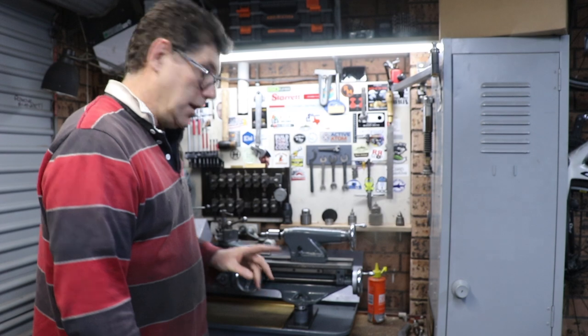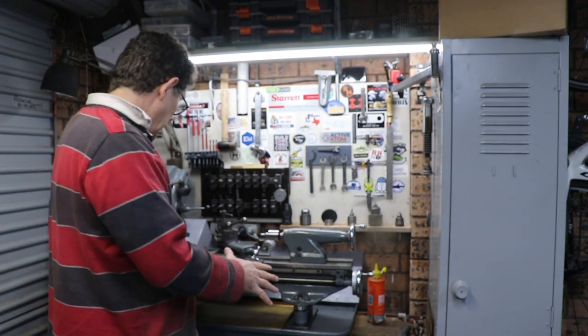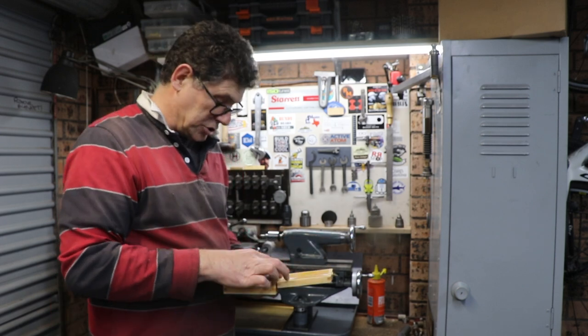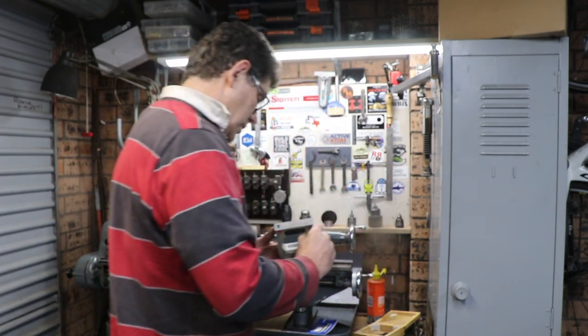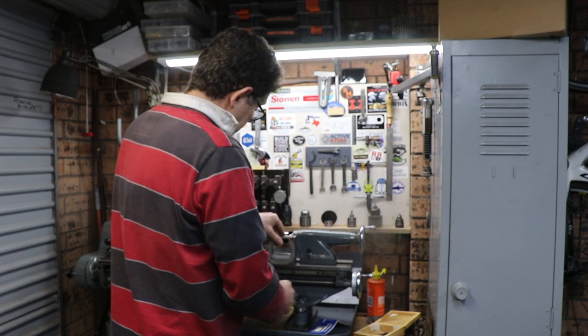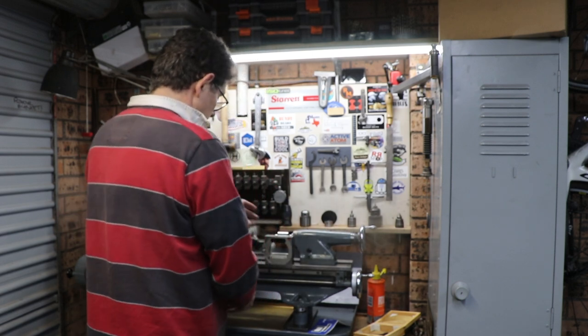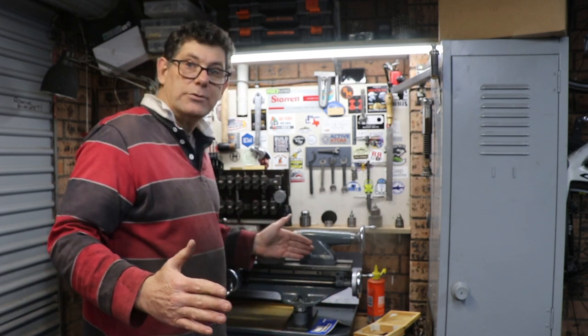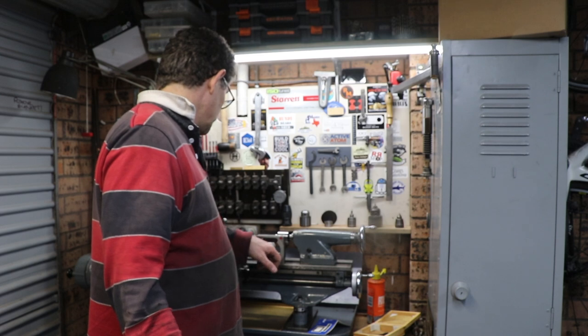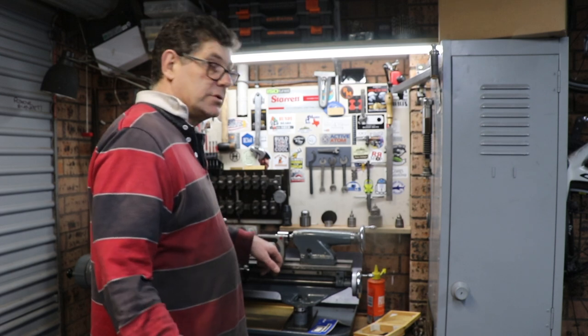Tighten them right down. Yeah, got the lathe back on, and then I used my machinist level. I've got this machinist level here, which is .02 millimeters per meter, so basically a thou. It's level to within a thou at a point. I shouldn't really mix my measurements. What's .02? 20 microns. 20 microns at a meter, which is really sensitive.